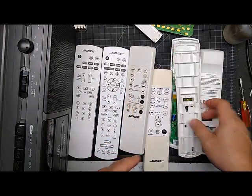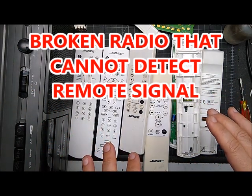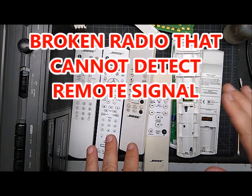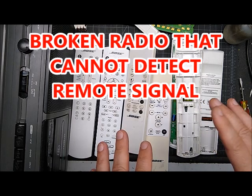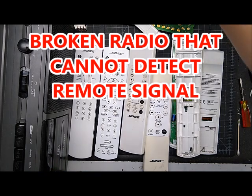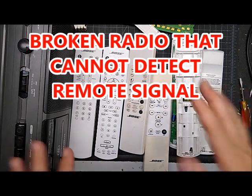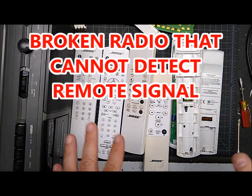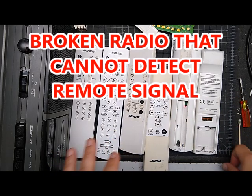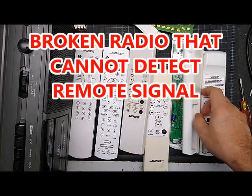It might take a little bit of effort. The base unit can break — I've got two test base units that I picked up ultra cheap and both of them are broken for the remote control. I had to replace capacitors on the main board; it was extremely difficult. You're going to need a lot of experience with a soldering iron. I needed special tools for testing capacitors, so that's a big deal.